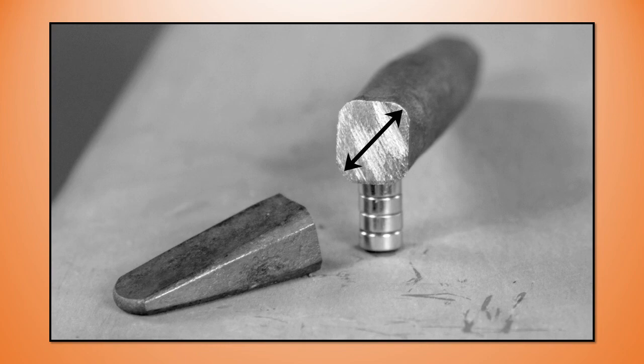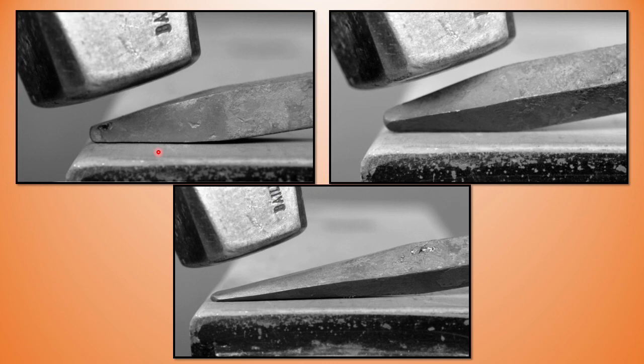For the diamond drift: this is why your blacksmith instructor told you to keep the taper in the middle of the bar as you work. I do a short taper, turn it on the diamond, and flatten it. If this taper was left or right of center line — not up and down, just left or right — as I flatten it it will be left and right, and I'll have to hit it with my hammer to bring it back to center, destroying that nice edge. Much better if the taper was centered before you start. You can see that the bottom side of that corner is thinner and the top side is thicker — I was holding my hammer or the work at a slight angle. I'll have to get busy with a file and clean this up.